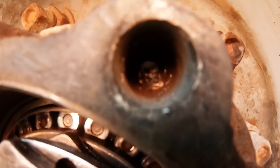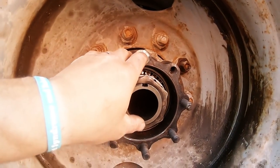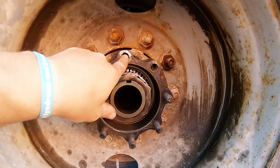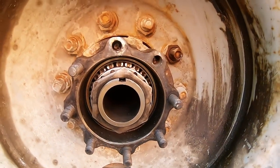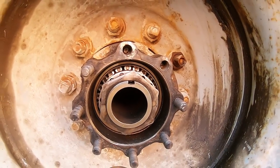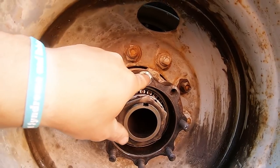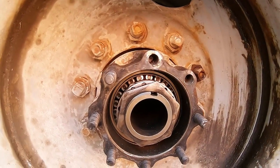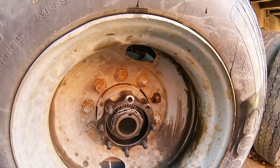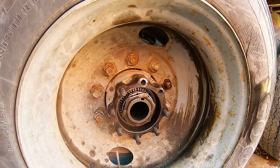Normally I could get studs out by welding nuts, but they're so deep and you can't get a socket in there to get on a nut, and by the time you do, it's a quarter inch nut, which has no weld power. So this morning I put copper tubing in there, filled the copper tube all the way up, put a nut on it. It's still not gonna do it, and time is money. We're gonna pull these tires, pull that hub, go buy a brand new hub, and I'll walk you through the process.